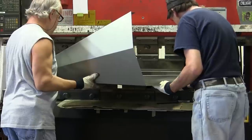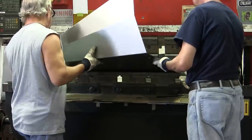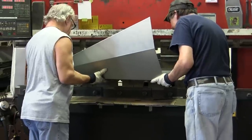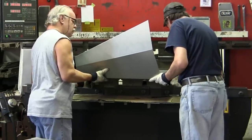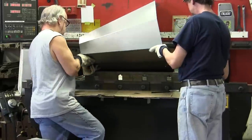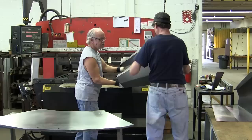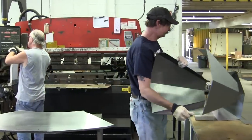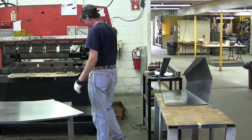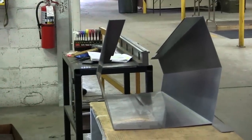On aluminum, sometimes just the grain finish is the final finish — it takes out all the imperfections and any scratches in the metal. It's got one more bend to do, and it's a bit tedious work — two guys have to be very careful. And that's it for the forming operation. We'd be inspecting those dimensionally as we go along, checking ourselves on each step of the process.